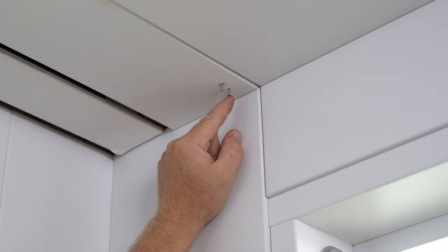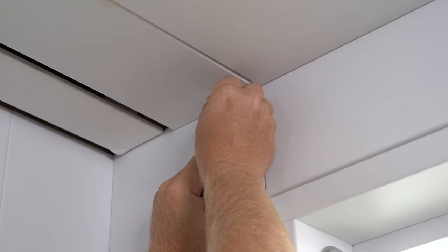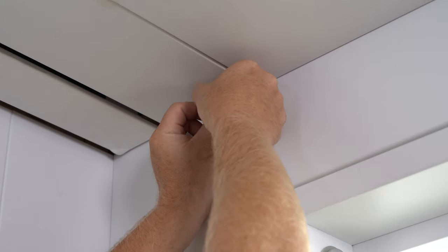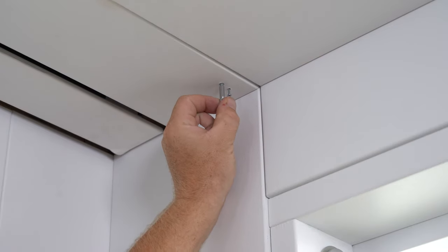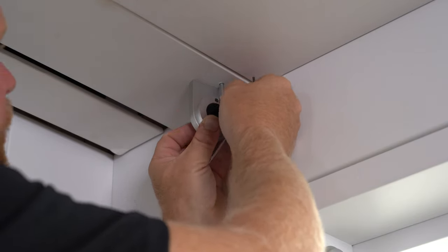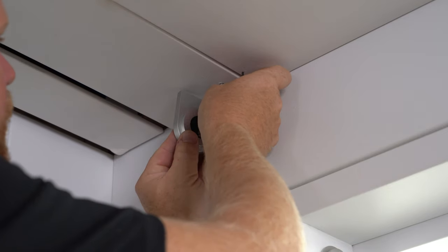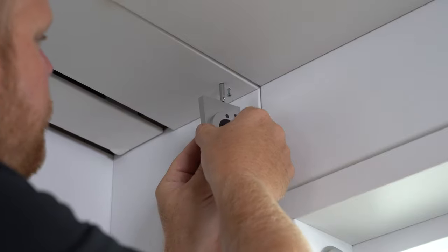Now, just like we did before with the coupler bracket, we're gonna put our sleeve on. Notice this sleeve's a little different. This is our round sleeve. We still have a handful of these going out to dealers, so I wanna make sure that you guys are getting to see what it looks like. Just like the last coupler installation, we wanna try and get our set screw to be just at the very, very base of the hole to ensure a good fit.